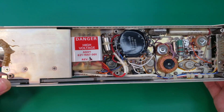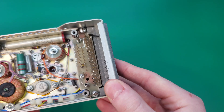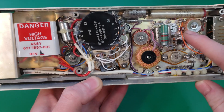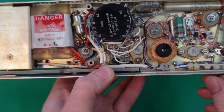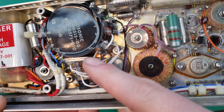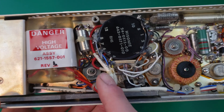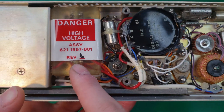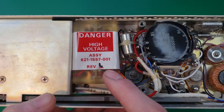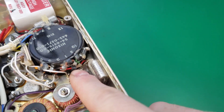Let's take a look at what was underneath that board. Starting from the right we have those pins which mostly go to the connector on the back. We have a lot of inductors in here, some smaller resistors, a few transistors, two higher power transistors, a big capacitor, and another little inductor mounted on bent-up pieces of aluminum. There's a big toroidal transformer here, some more capacitors and inductors, and over here the high voltage assembly — which I believe is for generating the high voltage needed to drive the amplifier tube. On the wiring to the toroidal transformer we also have some ferrite beads.